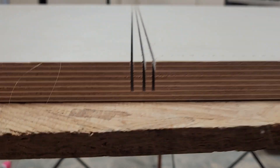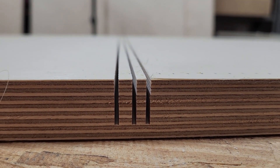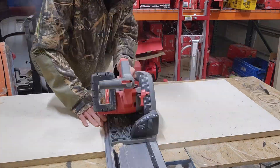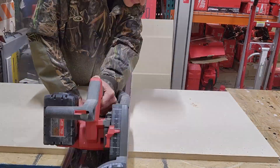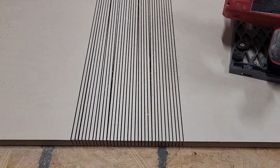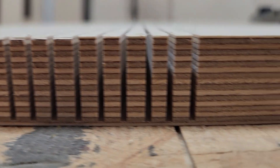For the benefit of anybody who is really wanting to know how to do kerfs: that is too much wood — I forgot to account for the thickness of the track. Now these don't have to be exactly spaced the same apart, but it is very helpful if you can keep them exactly parallel. Kerfing is done. Once again, that's about the width you want.